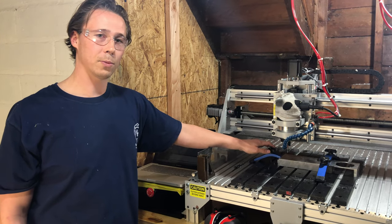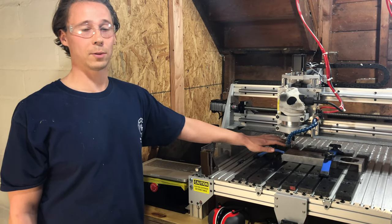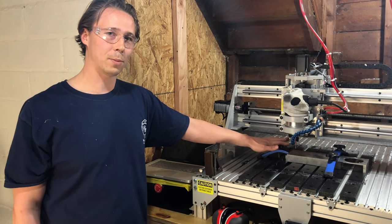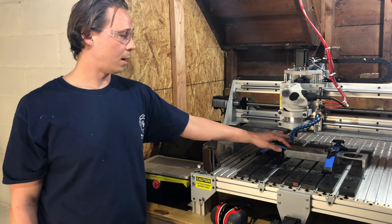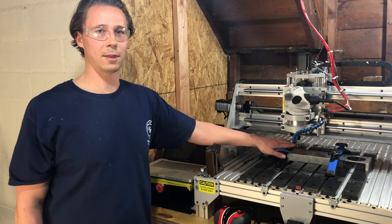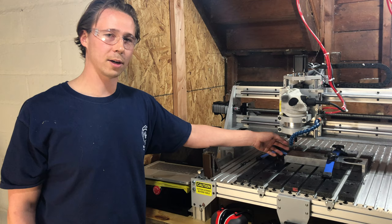The other thing I see a lot of is people using lower end or maybe even equivalent machines, but taking super, super light depths of cut and material removal rates that are just way lower than what is attainable. So I'm able to obtain about 1 cubic inch a minute of material removal rate, which is on the higher end of anything I've seen out there on a router. I'm gonna do a video on this in the future, but part of the key to getting that material removal rate is using a Datron single flute end mill. I will do an entire video on Datron single flute end mills, but the quality of the machining and the speeds you can get out of that are an order of magnitude bigger than anything else I've found. So that is the key. Also, you gotta be willing to break some bits to get there. These are about $70 a piece, unfortunately. So if you're scared of breaking them, you're never gonna push the limit and you're never gonna find out what you can do.